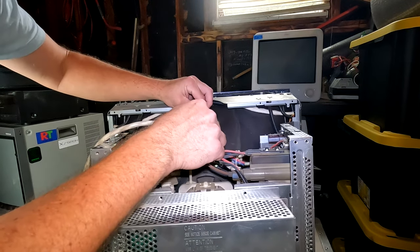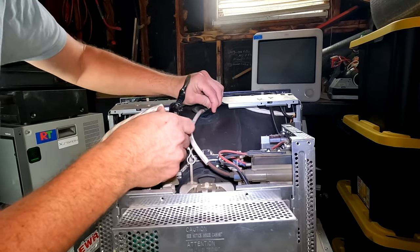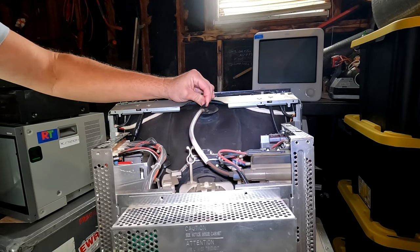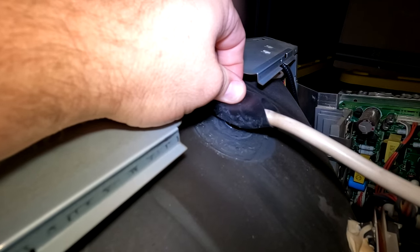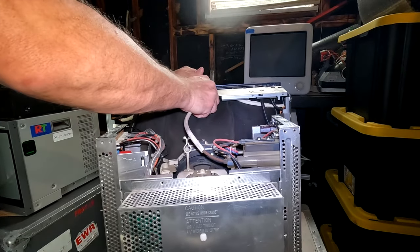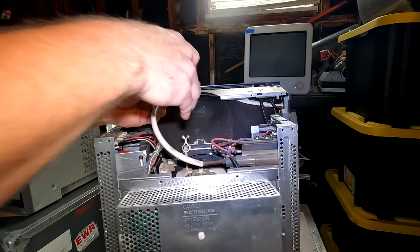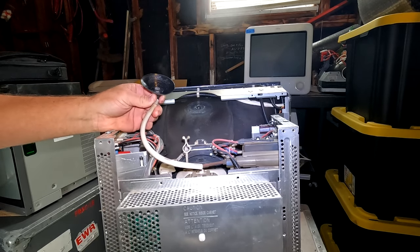The first thing I'm going to do is just lift up this anode cap and take a look there at our anode point. You see that in there? Down in there? So I'm just going to try to push this together and pull it out, if I can just squeeze it. There we go. See, so you can just squeeze that and pull it out like that. So it's actually not been discharged yet.